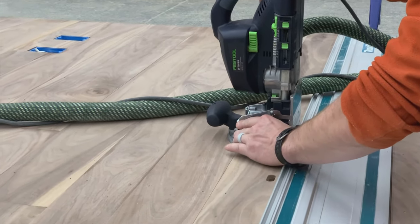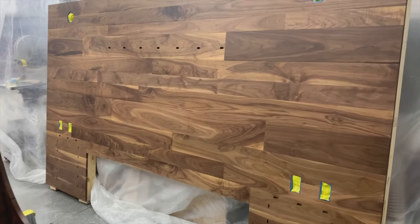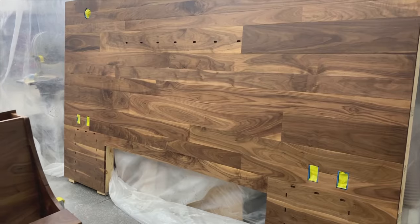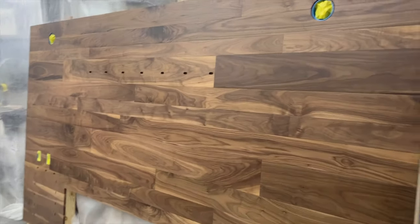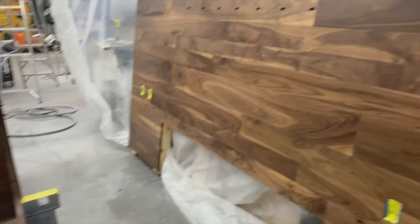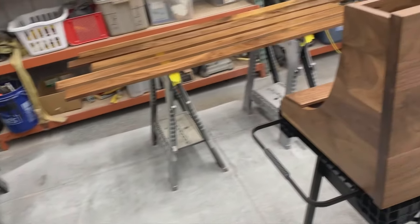Here we're drilling in dominoes that will hold the shelf across the top, and we'll do the same thing to hold in the end tables. You can see the holes drilled out for the shelf, and we went domino-crazy on those end tables. We did put blocking behind where we were doing the dominoes, so it's not just ¾ inch walnut — they go deep into some blocking as well. We didn't use glue with any of those; they're all dry-fit and then back-screwed from the back side. The beauty of that is we can pull it off the wall, take the screws out, and remove those end tables anytime we need to move.